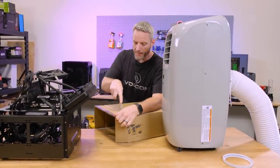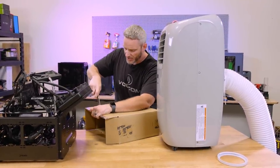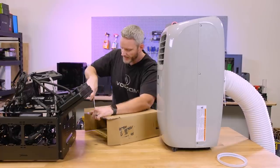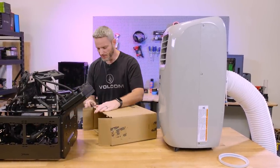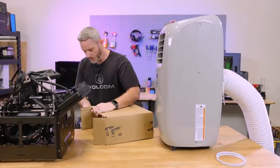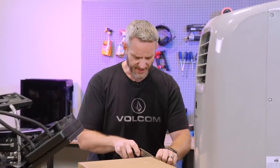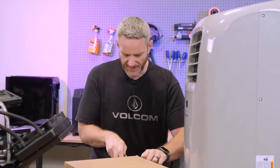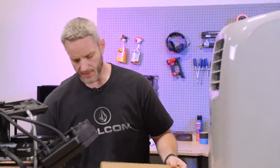That's probably the most common comment I get when I do these air conditioning videos, is, Jay, what are you gonna do about condensation? The temperature delta between the part we're cooling and the ambient temperature is not enough to create a lot of condensation. There's some, a tiny bit, but I don't need to insulate the motherboard or anything like we do when we do dry ice and LN2 and all that stuff.